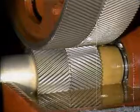Another method of lubrication, the oil bath, allows components to be partially immersed in a supply of oil. Oil baths provide oil for lubrication and also for cooling. In this example, a gear sits in a supply of oil. As the gear turns, its teeth pick up oil and carry it with them. The oil is transferred to other gears as they mesh with the one in the oil bath.